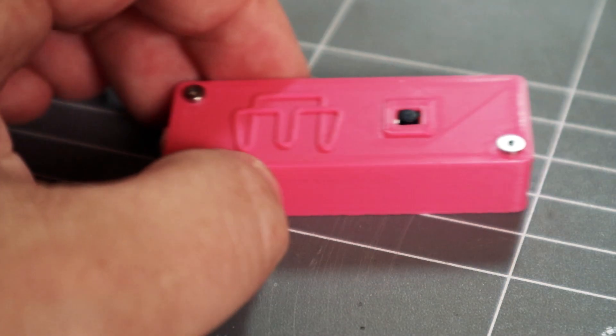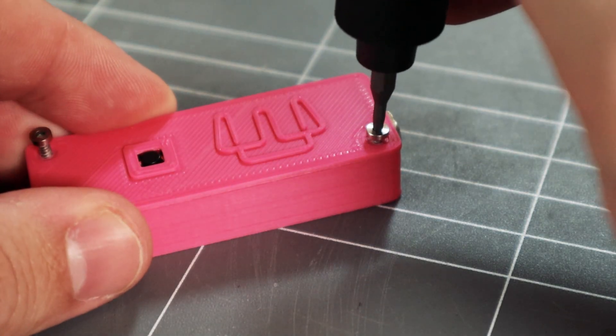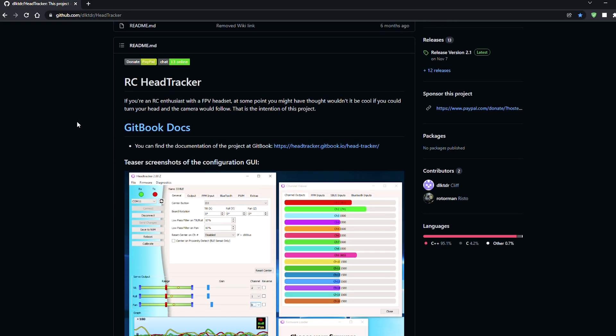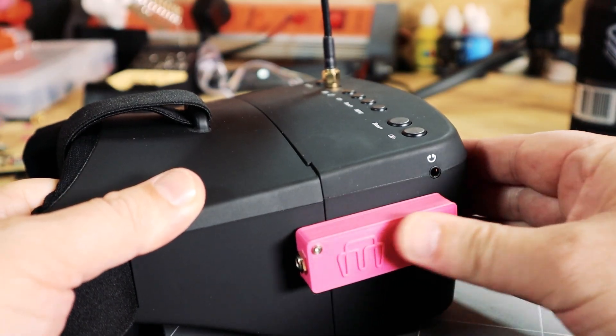To reduce the likelihood of reflection inside the dome I blacked them out. This tiny little thing will allow me to use my head to control the camera direction. Inside we have an Arduino Nano BLE 33, a mono socket and a tactile switch. There is zero coding here thanks to the great work of Cliff and a very intuitive GUI — a link to their GitHub is in the description. It's tiny enough to stick on your FPV goggles.